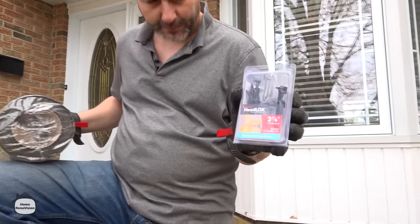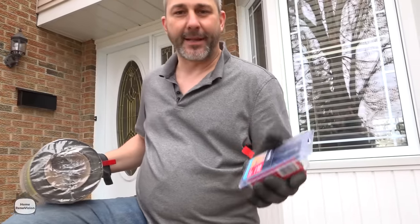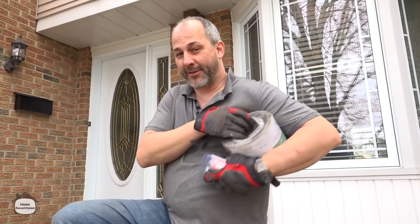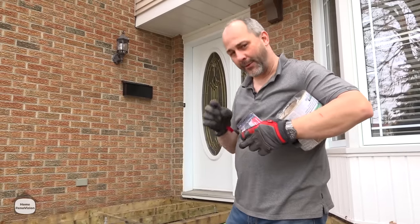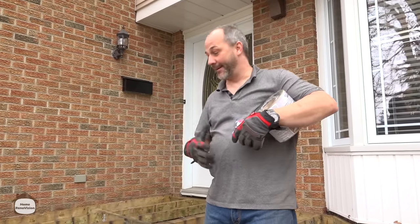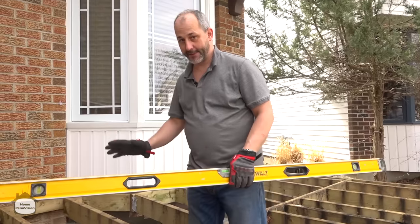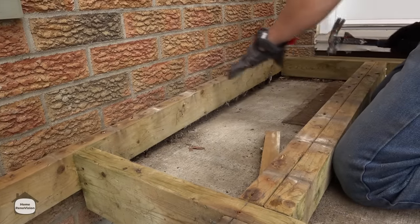The other thing we're going to use is headlock screws. I love this technology — they replace the strength of a 3/8-inch galvanized lag bolt and allow me to add structural strength to every piece of lumber I'm tying together, not relying on nails or screws alone. That gives me enough shear strength where I'm being creative with repairs, so I can carry the full weight of a whole family out here without any risk to their safety.